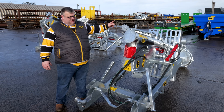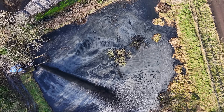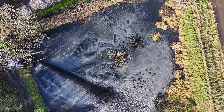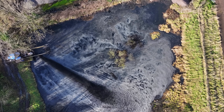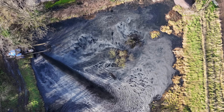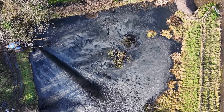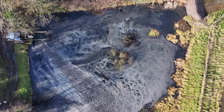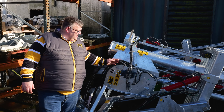There's the option of hydraulic rotation and a hydraulic nozzle, and it can be done on all the pumps. You have the option of a hydraulic version — these are manual, so you have to get out of the cab to change them over. Most cases you throttle the tractor down, knock out the PTO, get out, move your nozzle, then back into the cab and throttle up again. Just by chance there's one of the pumps in the yard — it's a 3800 with the hydraulic operation on it.